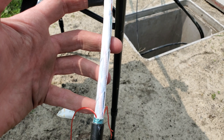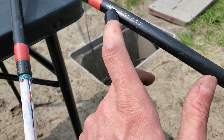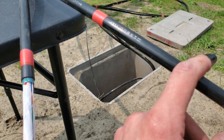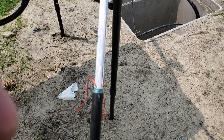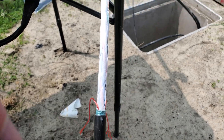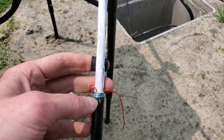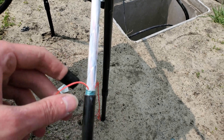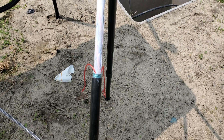Got about a hand-length there and my rip cords exposed. Going to go ahead and ring it right there — that was awesome. I was a little sketched out with the mid-span because the jacket and the metal armor were kind of melted together, but that went fantastic.